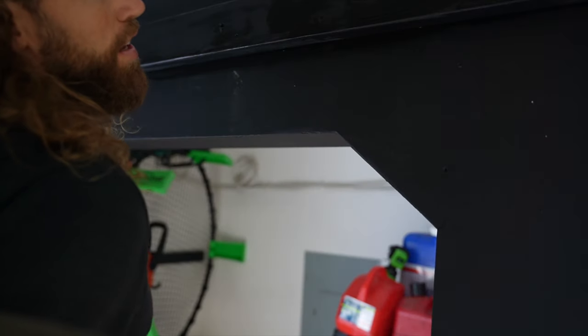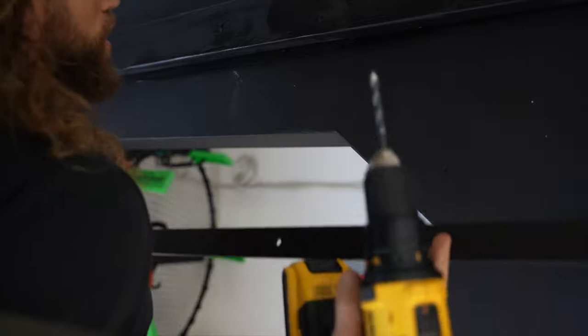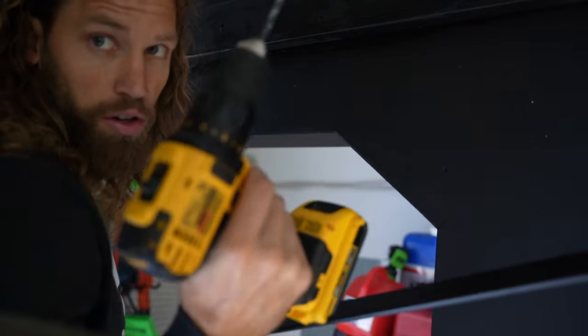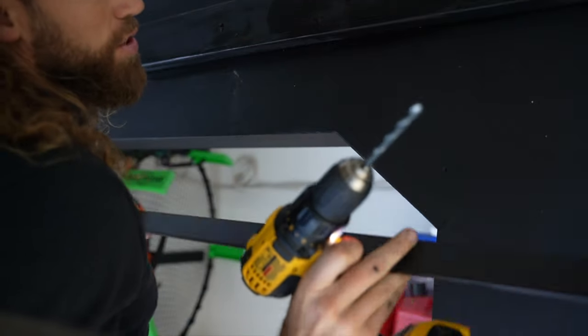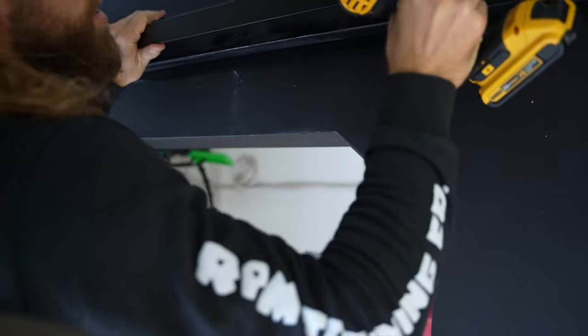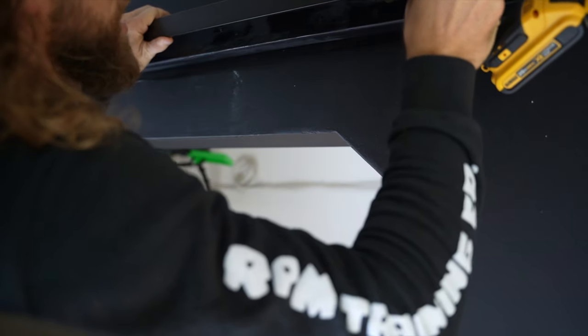What I learned today: people are nosy — my neighbors keep walking by and staring into the garage. I'm not going to wait for the paint to dry, I'm just going to put the barn door track up while it's wet. Could be a good or bad idea, let's find out. I'm using the technique of getting one screw in first, then leveling from there. Using big toggle bolts so I need to pre-drill.